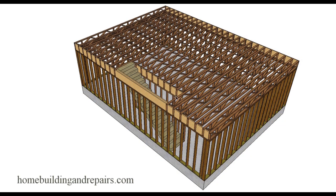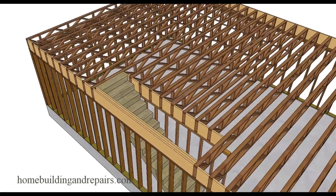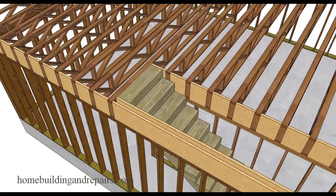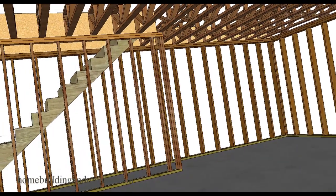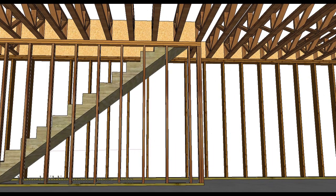Here's a good example: we have the full length 24-foot trusses and then shorter trusses. If we have a three-foot wide stairwell, these would need to be maybe three-foot six if you have 2x6 walls. The wall that the trusses sit on would now be a bearing wall, and if that's the case you are going to need a foundation underneath it. This might actually need to be a doubler or a beam in some cases, or the floor truss might stop here and a beam would be installed.